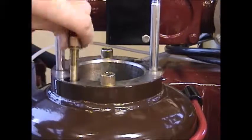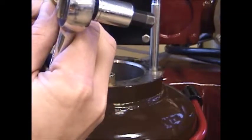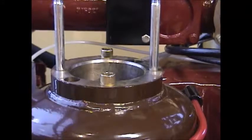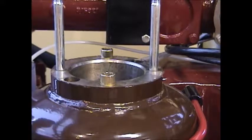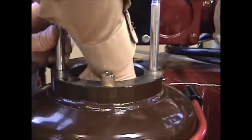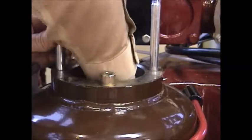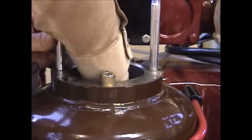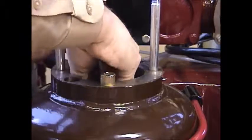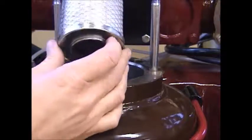And again, pay particular attention to the condition of the washer and the O-ring seal, and then set it aside. And then you just reach inside the tank, firmly grasp the separator cartridge and wiggle it side to side in a 360 degree motion. Just keep wiggling it side to side and pulling it up off of its seat. And then, once it's up off its seat, you can pull the separator cartridge from the housing,